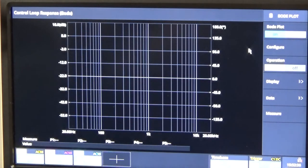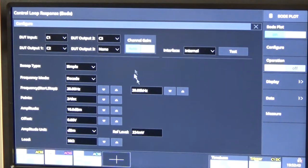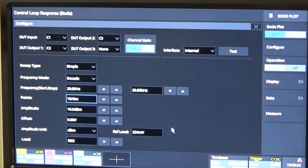We're going to use a Bode plot. Some people say it differently. What this is going to do is run a sweep of frequencies — we're going to go 20 Hz to 20 kHz. That's the generally accepted range of human hearing. Most people by my age don't really hear that entire range — 20 Hz you feel more than hear it, and by 20 kHz you normally can't hear it anymore. Usually about 16 kHz is where it cuts off, but that's about where you'd design an audio amplifier like this. We'll do 10 points per decade and just run it.